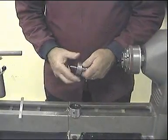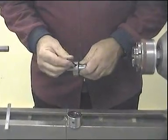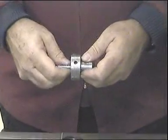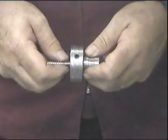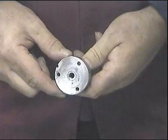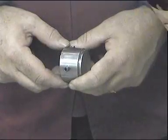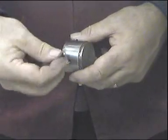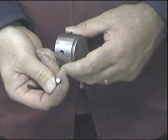The top section is fitted with a wood screw, held in place by a retaining screw. This can be withdrawn and use made of the 3 holes provided to turn the top section into a small faceplate. The retaining grub screws are fitted with brass tips, and this will prevent damage to the top section.